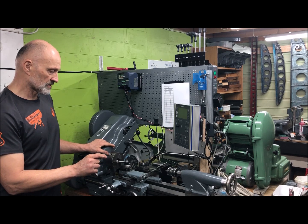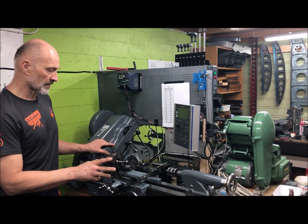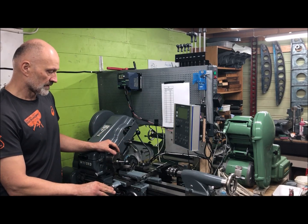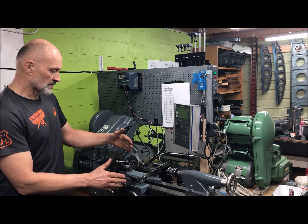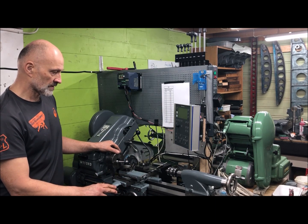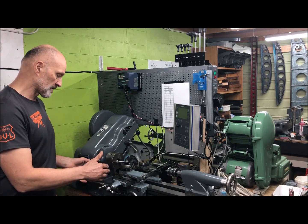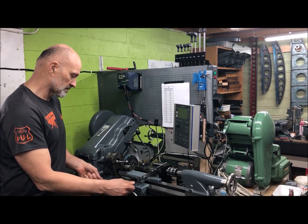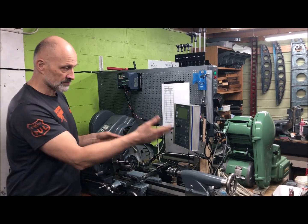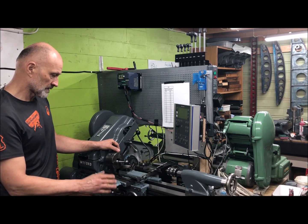On my drawing here, the numbers were incremental for the diameters and the length, so to interpret that with relation to using the ELS. I also like the possibility here now to go back and forth between manual and ELS - this is rather useful. This has its advantages towards converting it fully to CNC and losing the manual, or having a manual mode without a gearbox that's not so easy to thread. Still, with the threading here, you can thread at speed and with much more ease than you do normally. So that's an advantage.